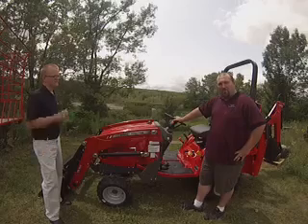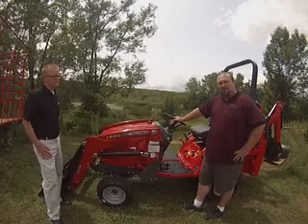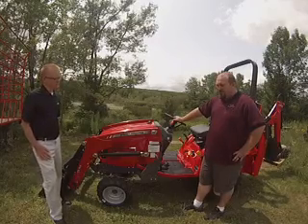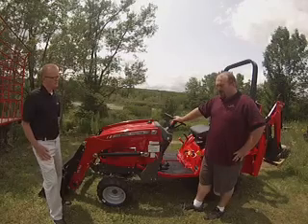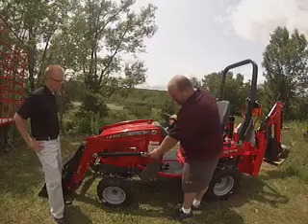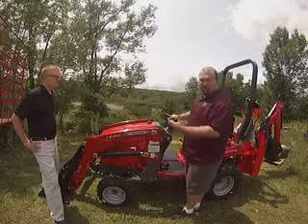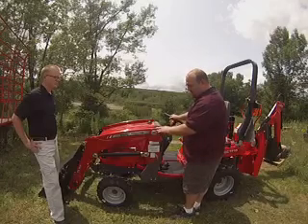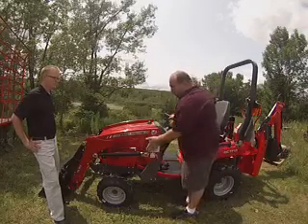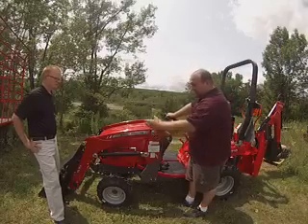Sure. As Blaine said, my name is Tim Goff, sales manager at Goff's Equipment Service in Litchfield, Connecticut. You can visit us online at www.goffsequipment.com. The DL95 is a new loader to our GC1700 series lineup with quite a few new features. Probably the biggest thing I noticed was the recessed grease zerks — grease fittings here in the end of the pins. These pins are now galvanized and there is a hole cut in the frame of the loader to lock the pin so it doesn't rotate while transporting material. And it also has those grease zerks in the end of it. The nice thing is you can get to them all from this side or the right-hand side — no reaching in the back, no reaching underneath, getting grease all over you. It's very easy to grease the pins of this loader.